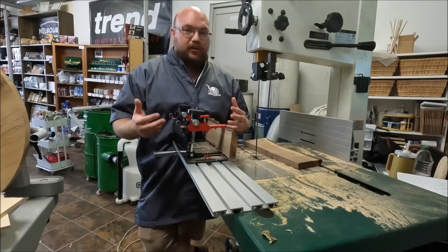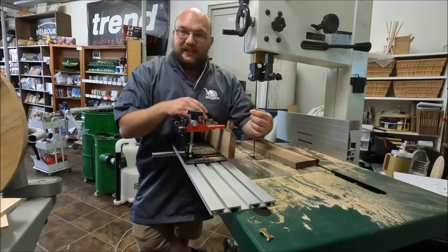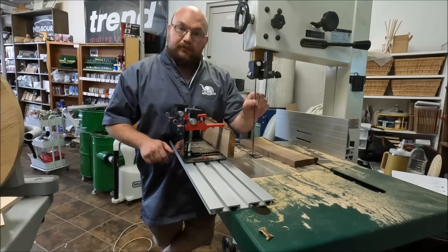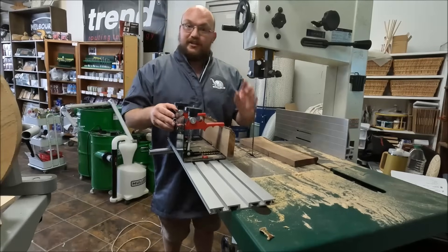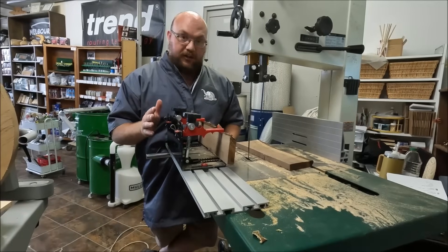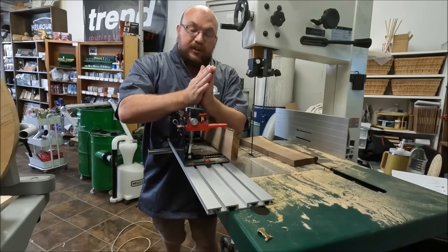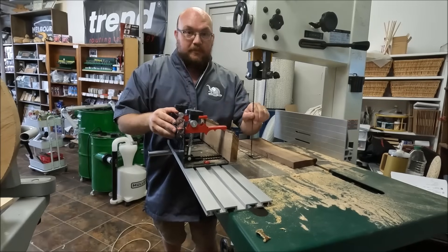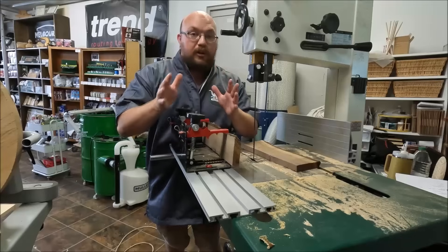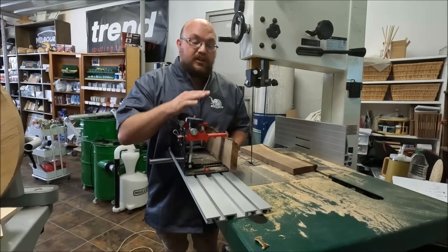Now there's a lot of things you can look at - how your table is aligned to the blade, your guides, your setup, maybe the blade itself - but today I'm going to talk about the one and only reason that your bandsaw drifts. Simply put, it's always, a hundred percent of the time, your blade. The blades are designed with teeth on the front that are bent out, and it's very easy to damage a bandsaw blade, very easy to modify the set, which will make it drift.